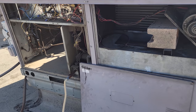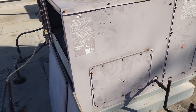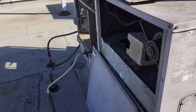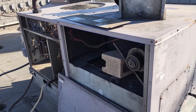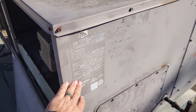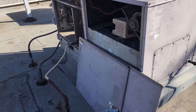So we're gonna have to give this customer a quote. Now, I believe this is a 6-ton, yeah, this is a 6-ton R22 package unit. In a perfect world, they replace it, but right now, you can't get equipment, right? We don't know. So, we're gonna give the customer options, we're gonna let them make decisions, but we need to gather information. So, models and serial numbers, pictures of the unit, overall condition of the rest of the unit.